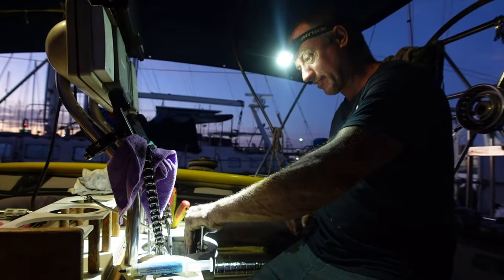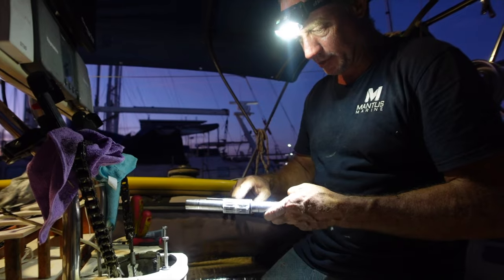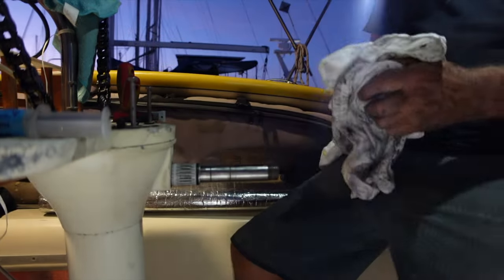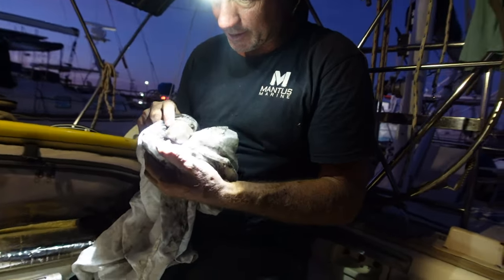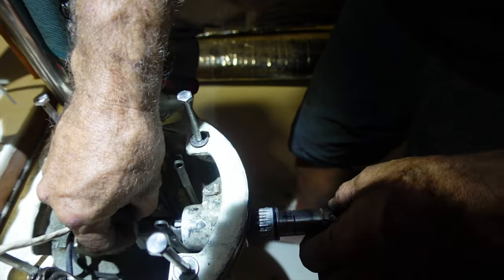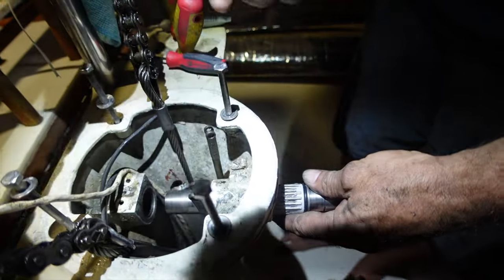Back to it — all I really wanted to do was redirect some wires, but look what's happened. I'll put the new keyway in, the new bearings are in here. I've slid down the new rubber with the washer and retainer and I'm going to slide that in now — just lubed it up. I've slid my shaft in there. You can see there's a bit of wear on one tooth there, which I'd say is from where it keeps rubbing on the wire — that's worn on both of those teeth.